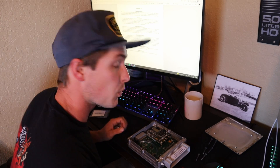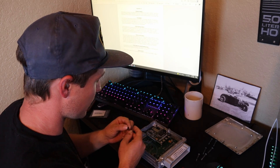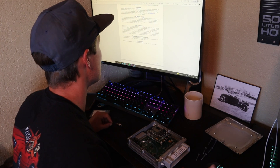JP19 is a three-pin jumper and you're on pins 2 and 3, which is 12 volt - it even says it on the bottom of the motherboard right next to it. That's it for the mandatory jumpers. Now we get into optional jumpers. The first optional one is for electric fan control - if you want fan control, install JP3, and it even says 'fan' on the board. We're going to install it now since we'll be running an electric fan at some point and don't want to take it back apart later.